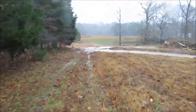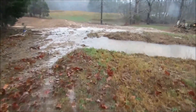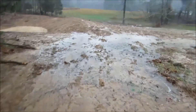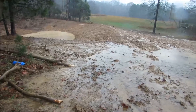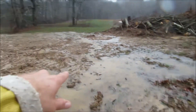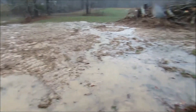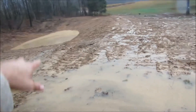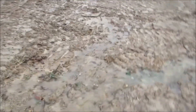The only issue I have is down here — it's overflowing where I wanted it to, but not exactly how I wanted it to. There's a new dam here and I wanted the water to come out of this swale and spill over right there into the pond. It is doing that, but only about a third of the water. You can see the spillway — water is pouring down heading towards the dam, but a significant part is actually pouring out behind the dam, which is not what I want. That's an easy fix — I'll bring some of this material here once it's dried out and make this mound a bit higher. I thought it would be high enough, but I'll bring it up five or eight inches and that should catch all the water coming out of this swale.